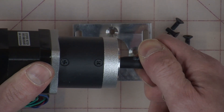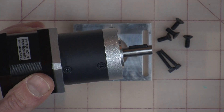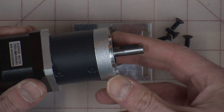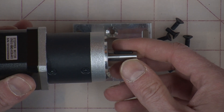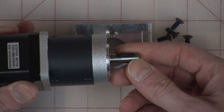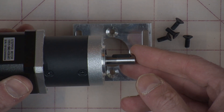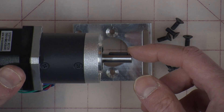The first thing we've got to do is get the key off. Will we get super lucky and the key just comes off? No, of course not. We have a choice: we can either remove the key, or we can broach a keyway in the sprocket, just like the other one. But it's easier to drill and tap, so we're just going to get this out. Our first fight is removing this.